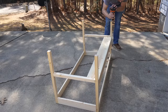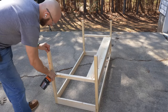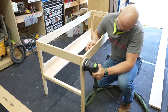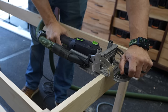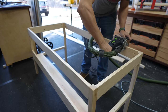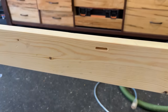I used my router and a one-eighth inch round-over bit to slightly round over the bottom of those feet — it'll give a nice finished look and keep them from splintering later. I also rounded over any edge I could get that router on. I sanded the entire frame with 120-grit sandpaper, as well as the shelf. To attach the tabletop to the frame, I'm using a Festool Domino — it's a little overkill, but it was the easiest way to cut a simple slot. You can use a one-eighth inch straight bit on your router with an edge guide, or a biscuit joiner will do the exact same thing.